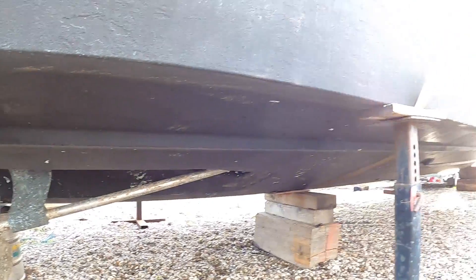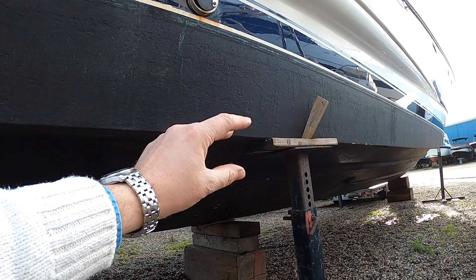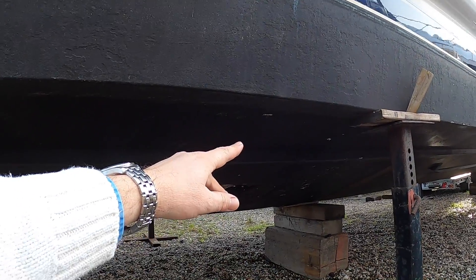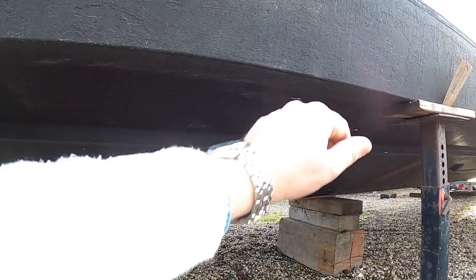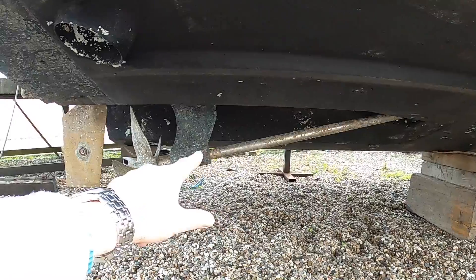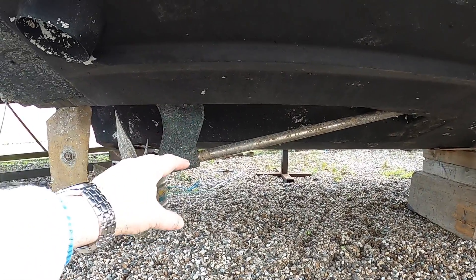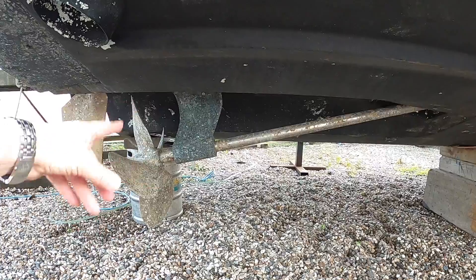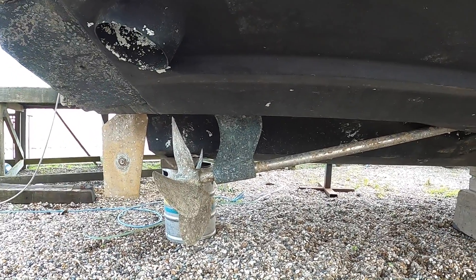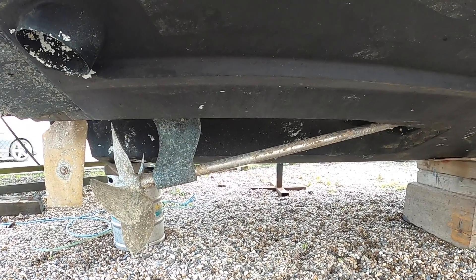With shaft drive, the engines are up a little bit more towards the centre, they're angled down slightly, they have a gearbox on the back of them and then behind that is a shaft. The shaft goes through the hull through what's called a stern gland that stops the water going back through the other way, and then you have this stainless steel shaft that comes down. You've got the P bracket — that's this fellow that hangs down that supports the shaft — the propeller is on the end, and then you have rudders behind to steer the boat.